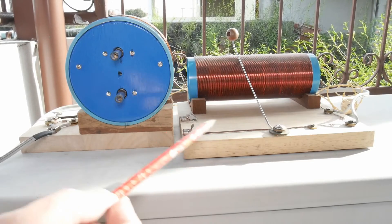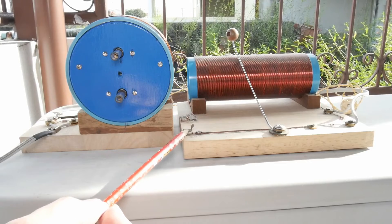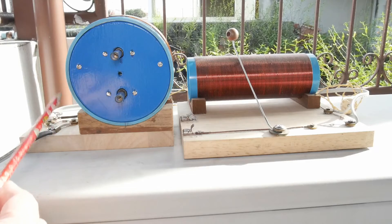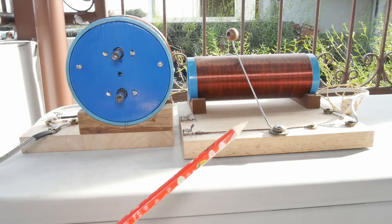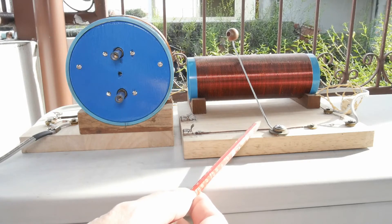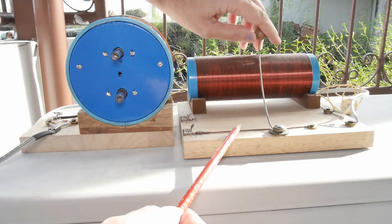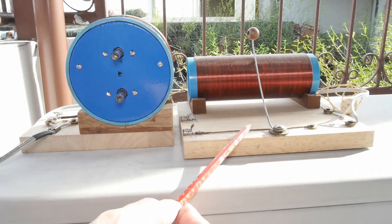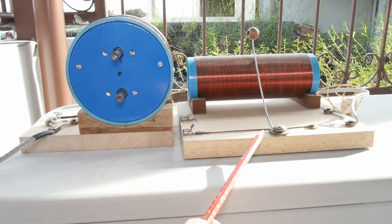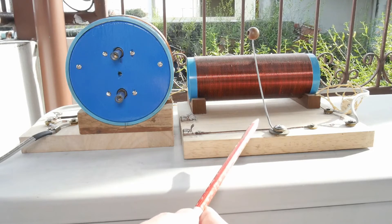The ground is not really that important for the Boy Scout radio — I've gotten very good reception without a ground. But for this ARRL version, absolutely you must have a good ground. Both of them require a good antenna. The Boy Scout radio's tuning is very simple — you can just slide it back and forth — but because of this tuning you get a lot of cross talk. If you're trying to pull in a weak signal, you'll oftentimes hear other stronger stations in the background.